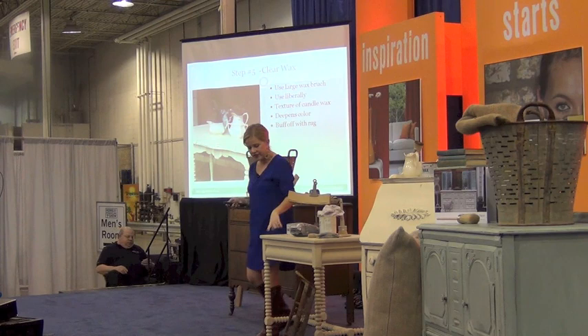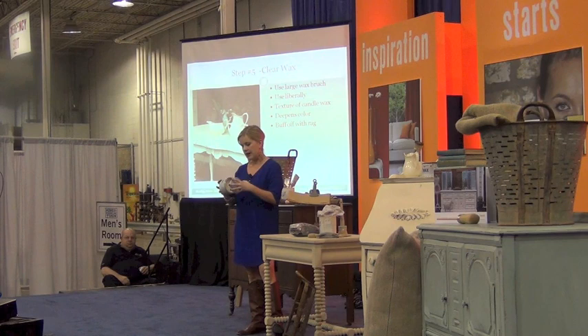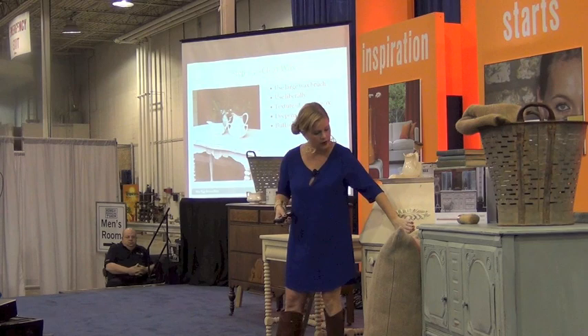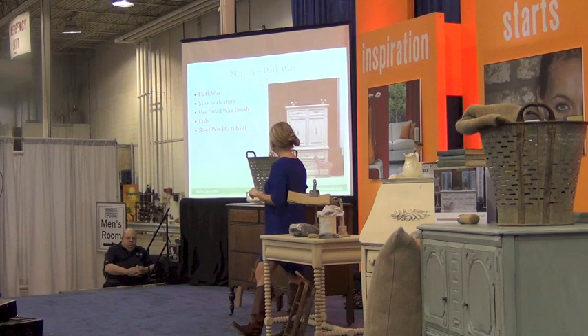This is the matte finish — two coats of chalk paint and it's very matte. The clear wax is like a candle wax. When you apply it, let it dry, and then buff it, it's going to give a little bit of a sheen. It takes away that chalky texture and leaves just a little sheen. I think without wax it looks a little dull, but certainly if that's what you like, there are no rules.